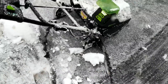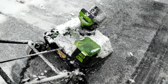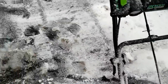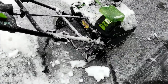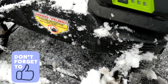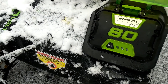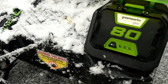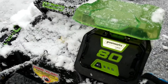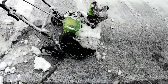I really wanted to see how long the battery would last, but it's just too wet and heavy. I had to keep stopping and clearing it — it was jamming in here. So that tells you something: if it's a wet, heavy snow, three and a half inches is over the max. I was 11 minutes in on the battery and I'm down to one bar. Heavy use, I'd say you'll get 15 minutes out of the battery. Lighter use, you could get probably 20 minutes. And it takes about 20 minutes to charge. Would I recommend one of these? If you're in an area where you get a lot of light snow, a couple inches, or if you're going to go out every couple hours during a big storm and do two or three inches at a time — yes.